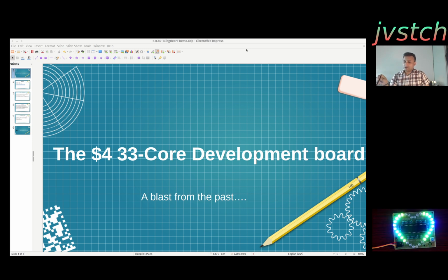It's very pleasant to watch these effects, because what they did is it's a very simple microcontroller with 4 8-bit ports, I think P0, P1, P2, P3, all 8-bit, and so they have altogether 32 LEDs, each wired to these ports, right? But that only gives you one channel for each LED, so they have supplied this board with 32, or I think they gave 40 plus around 35 or 40 LEDs, which are self color changing LEDs.